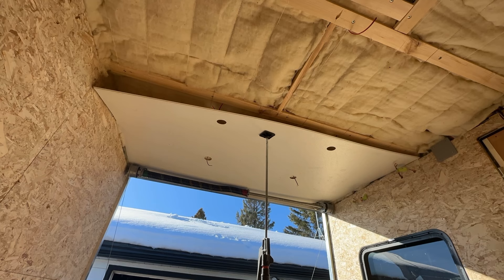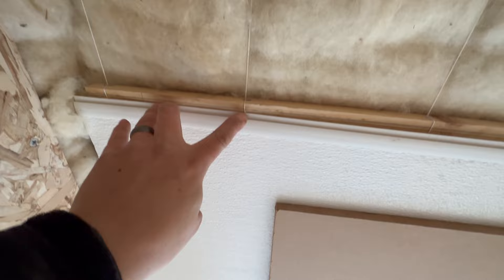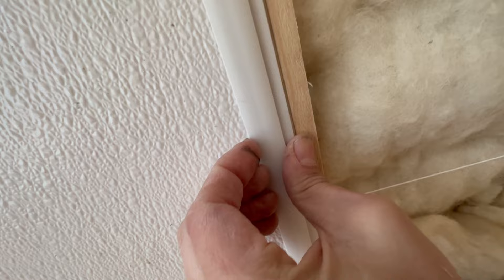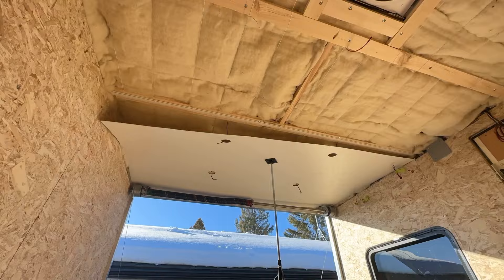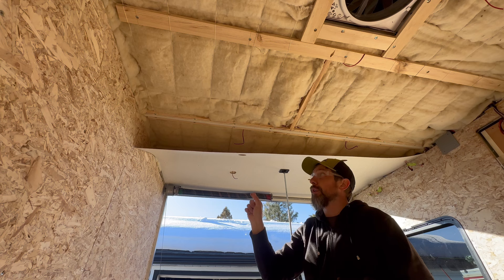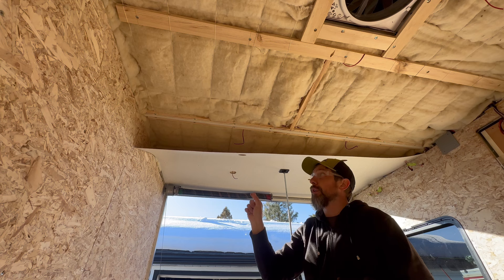Next I needed to attach the H-channel trim molding that goes between each panel. I placed the trim up against the wood and traced the line all the way across, then changed the angle of the pencil and went about a heavy eighth of an inch down. When I go to actually secure it I'll shift it over to that line to give the panel a little bit of wiggle room and make sure it's not tight. I got that trim glued and screwed in place. My other idea was using a flat PVC trim and screwing the panels in the middle, but I wanted to try the H-channel first.